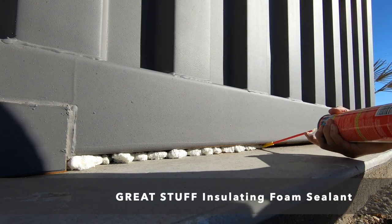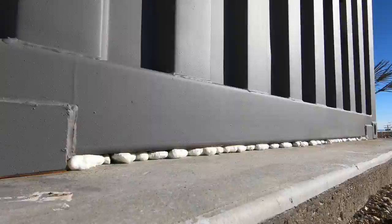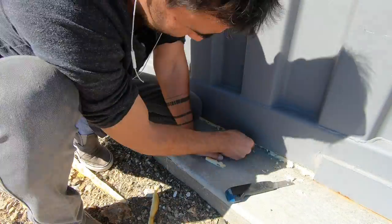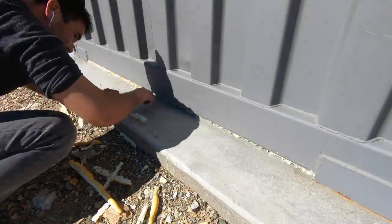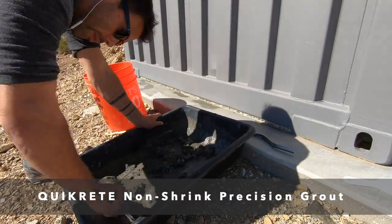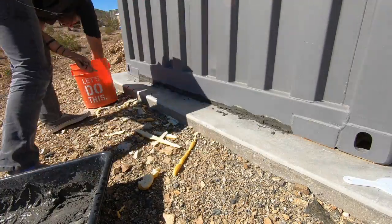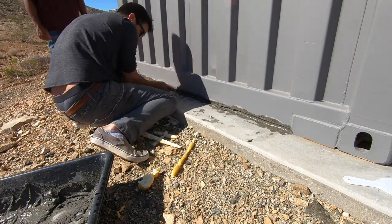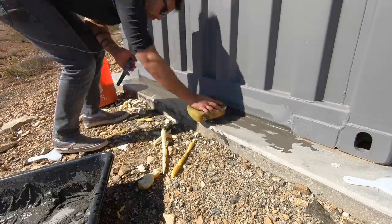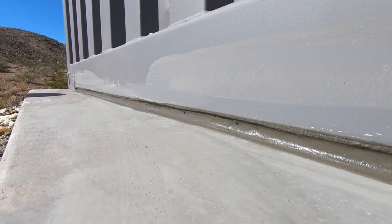Alright, back to the build. Once the paint had cured I used spray foam to close up the space between the containers and the concrete slabs. The blocks at the corners of the containers hit the concrete but everything else floats about one quarter of an inch above it. This foam will provide backing for the grout I apply next. The foam expanded out of the crack and I used a knife to cut away the excess. We mixed up a batch of Quikrete precision grout and pushed it into the crack all the way against the foam, applying it generously with a wide putty knife. I used a masonry tool to get a nice finish on the grout, scraped away the excess, and cleaned everything up with a sponge. This isn't just for looks — it's also critical for keeping out little critters and varmints from hiding underneath the container.